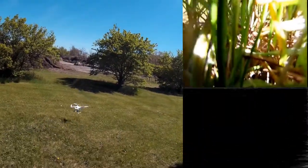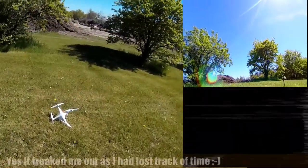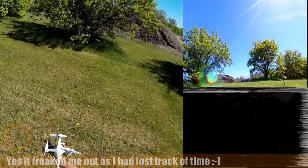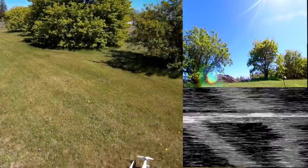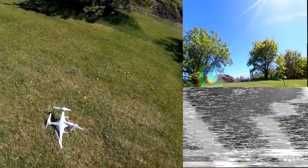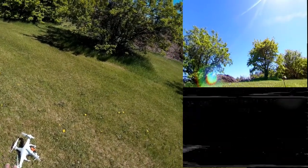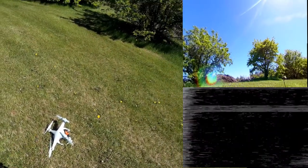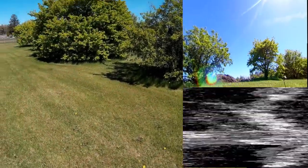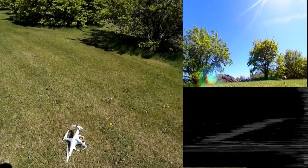Okay, we're going to land it. That last part was interesting — it went into low battery mode and it wanted to go home, which is good because I started out over there and that's why it jumped up on its own. The lights went to all red from green, so I brought it down pretty quick. One thing I did notice is when it went into return-to-home, the stick stopped responding. That's something I have to be careful with. After it started the return-to-home sequence I was able to get control back. This is one of the reasons you want to take a copter out and experiment to understand how it's going to fly before you take it out around people and other things.